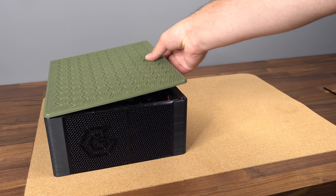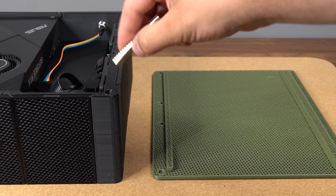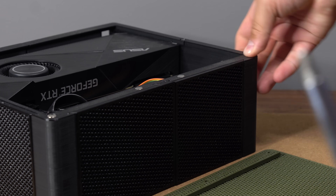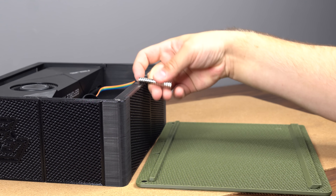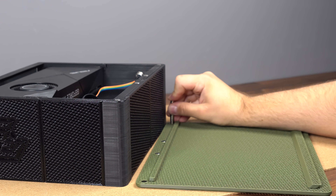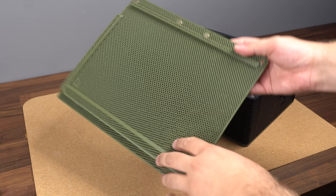To install the magnets, lay the chassis on its side before placing the correct side panel, then flip the side panel over so the magnet sides of both parts are facing each other — this way you know which magnet holes need to align. Start by pushing magnets into the four holes in the main chassis, which may need a tiny amount of glue depending on your printer's tolerances. Then stick a stack of magnets onto the already-installed magnets before flipping it 180 degrees into the opposing hole — this ensures correct polarity every time. When all four magnets are installed, the panel should just snap into place.